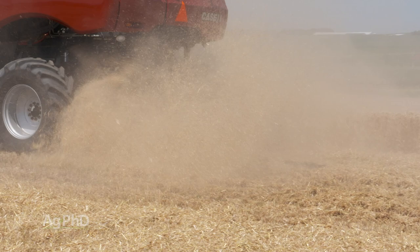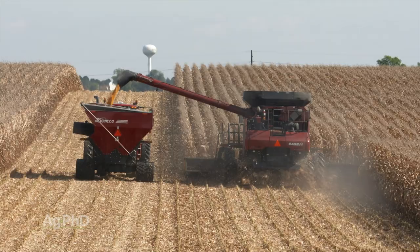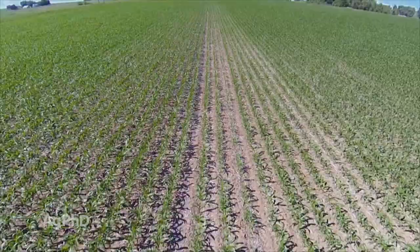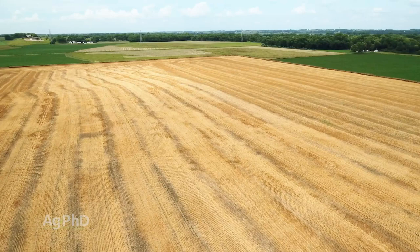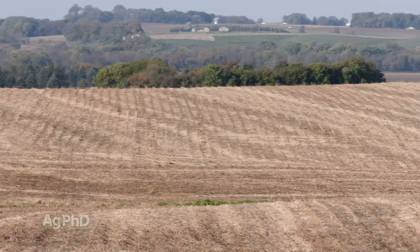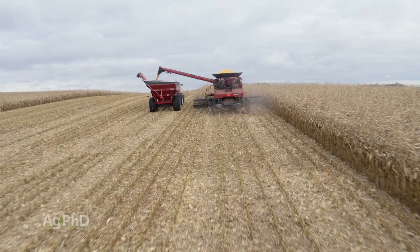The other thing I want to come back to with the combine is just how you are spreading that residue. With your spreader, I want you to really look this fall — is it an even spread? Too many times Darren and I will take a look at fields and we see streaks the next year. You go back to: why are we having streaks, why do we have uneven emergence? And what it comes back to is how much residue was left in certain spots, and you trace it back and go — wait, this was a combine issue. The combine was leaving streaks of residue out in the field, and that in turn led to poor emergence in the spring.